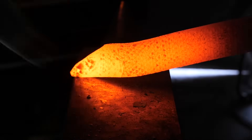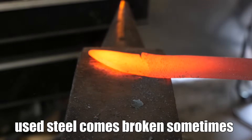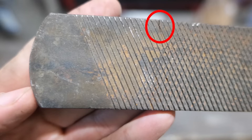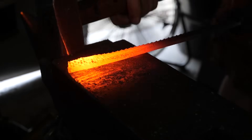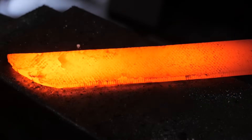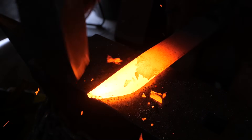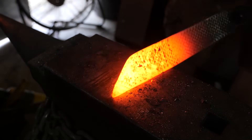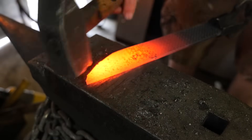I don't know why I'm bothering to forge this — I guess I just needed a JFAC project and this is the first thing I grabbed. Sometimes scrap does come broken. This one had a little tear in it; if we go back we can actually see that tear in the first shot. I just wasn't paying attention and didn't inspect it closely, and that was a big mistake. I did a video for Patreon subscribers asking the question 'is scrap crap?' and yeah, I answered yes — pretty much it is. It's got stress fractures and you don't know what type of steel it is. Sometimes the appeal of using something old and transforming it, carrying with the new item the sentiment of the old item — I think there is some value in that.